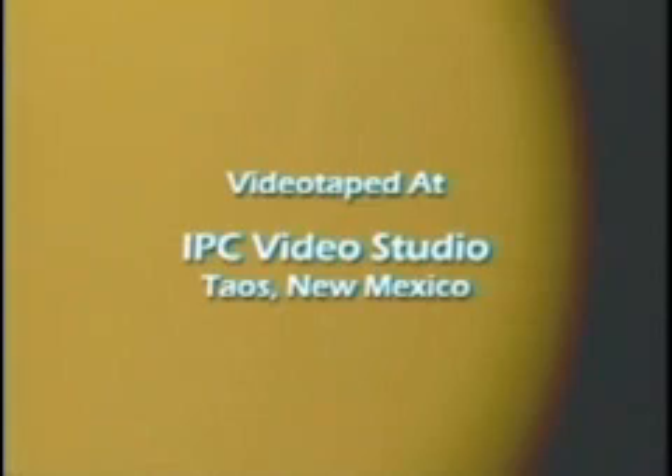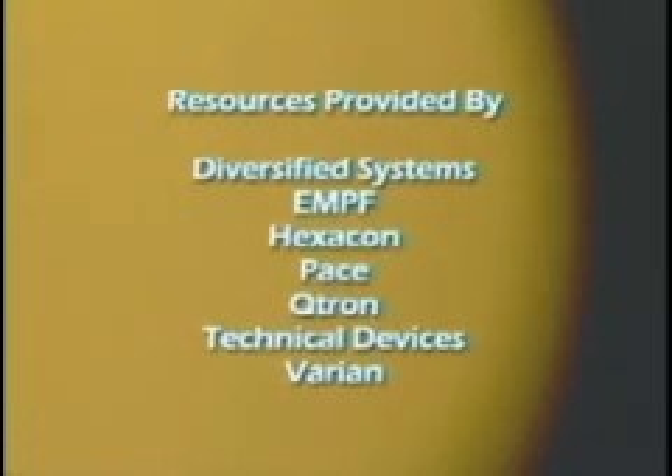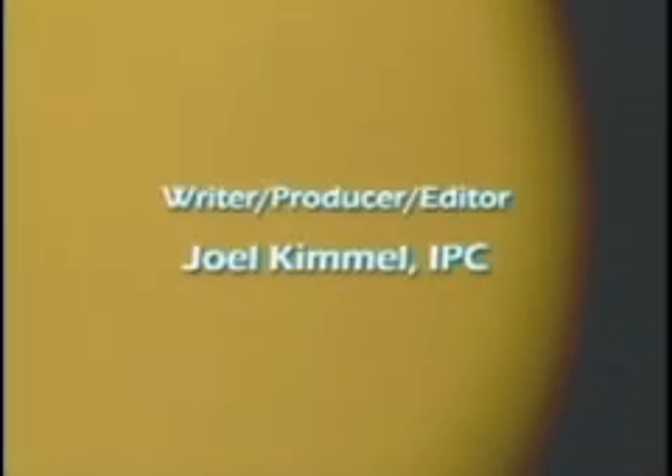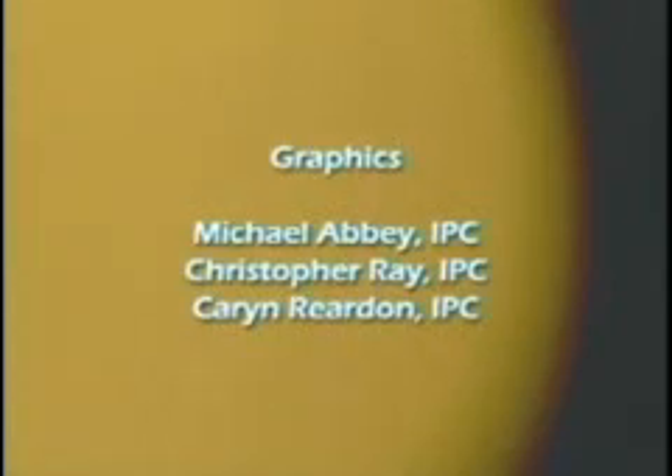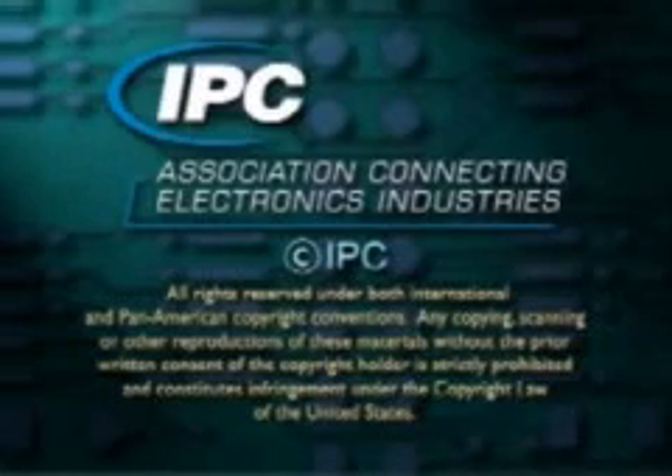This program has provided a refresher course in how to break bad soldering habits. The seven sins are the most common habits we get into. A properly applied soldering iron and solder heat bridge, along with a documented process, goes a long way to ensuring consistent, quality work. Let's review the list one more time: excessive pressure, improper solder heat bridge, wrong tip size, excessive temperature, improper use of flux, transfer soldering, and unnecessary touch-up or rework.